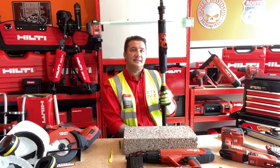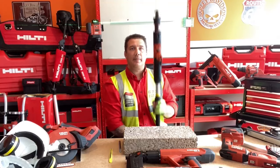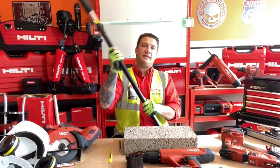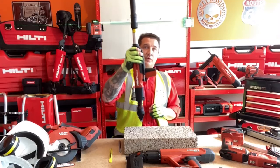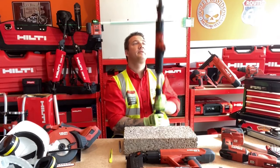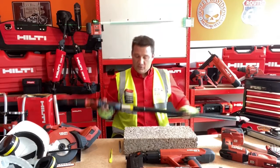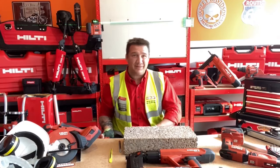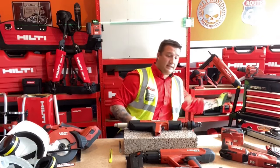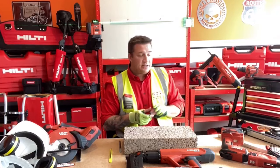You put the clip with the plastic washer on the end, raise it up comfortably. There's a safety feature with a weight at the bottom: if the tool is at an angle it won't fire. You rest it against the soffit and once comfortably against it, pump the tool to fire. Then simply bring it down, put a new clip on, walk along your laser line and do the same again. It saves you working at height, saves you drilling, takes away the dust, and removes the health and safety risks of inhaling dust or falling from ladders. It's a great tool for this application — give us a shout and we'd be happy to come on site for a real demonstration.